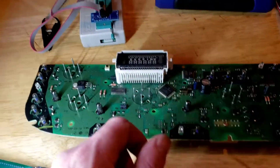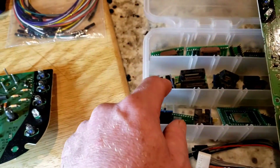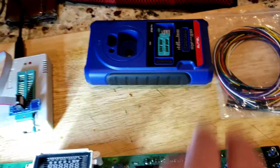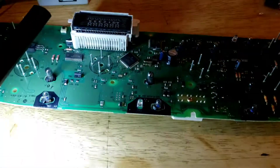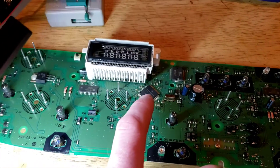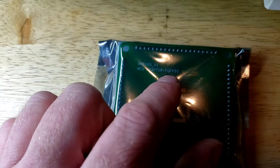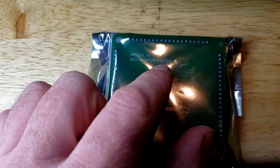There are two ways you could do that. You're not going to do it with the EEPROM reader — I have all the attachments here, but it's just for EEPROM. I'm going to have to use the IM508 with the XP400 Pro. What I could do is desolder it from the board — it's soldered on this breakout board here.